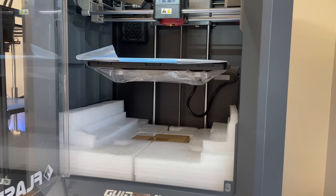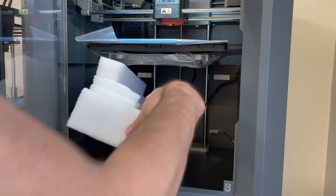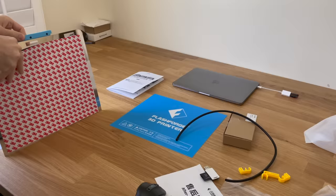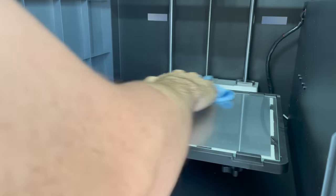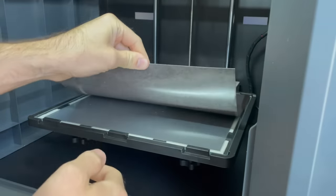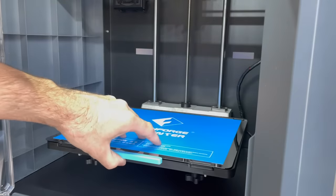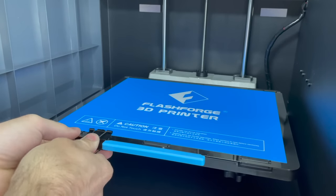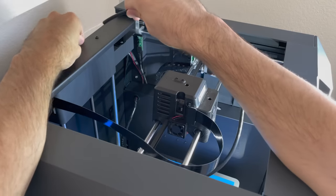There's a box with all the extra extruder nozzles. Now, looking at the instructions, there are a couple of options for the bed — it comes with flex plates and has a magnetic piece you can put on the glass bed. You can print on the glass bed using the glue stick for better adhesion. I'm going to use the magnetic build plate — clean it off with Windex, put the 3M magnetic piece onto the glass bed, and it slides and magnetizes into place. It comes with clips, and for anything over 150mm it recommends using the clips to keep the bed secure.